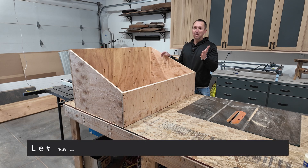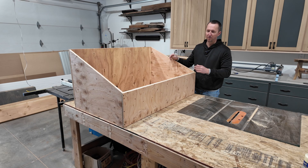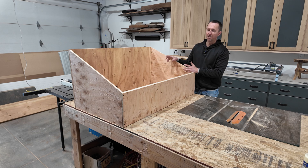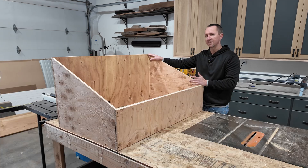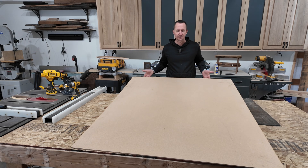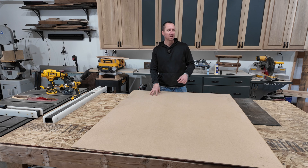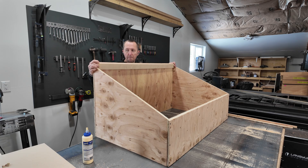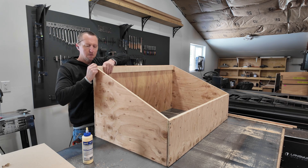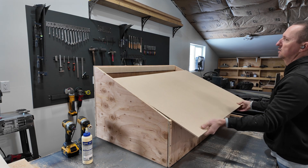I don't know, I'll let you know how it goes - let me know if you have any ideas with this. The box is put together now; I'm going to start working on the lid. In this lid I will be putting plexiglass, but unfortunately I had to order it - it's on its way. For the lid I'm going to be using this quarter inch MDF. This is the same stuff my shop is paneled with, and I have to use it because I didn't have enough plywood left over. I actually think this will be better because it'll be quite a bit lighter, easier to lift and get things in and out. When I mocked up the door I was having issues with it sagging in the middle on top, so I made up this little cleat with the same angle - it's going to slide in here and help hold that door and add structure to the whole unit overall.